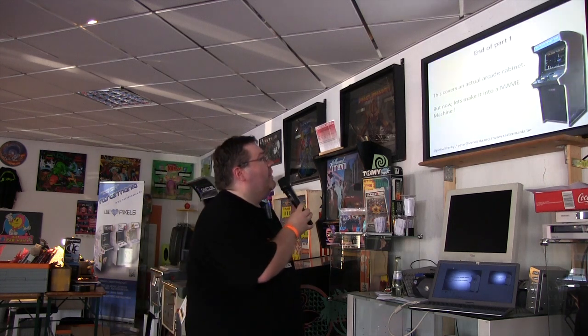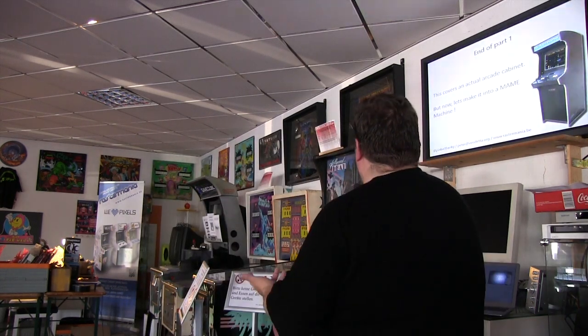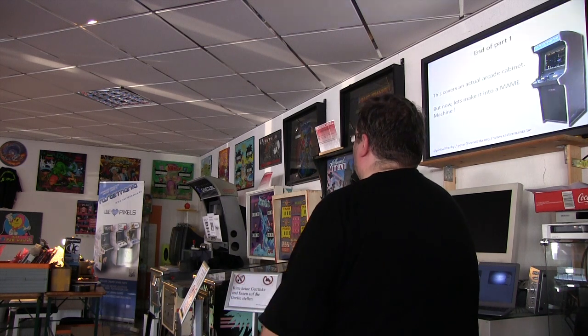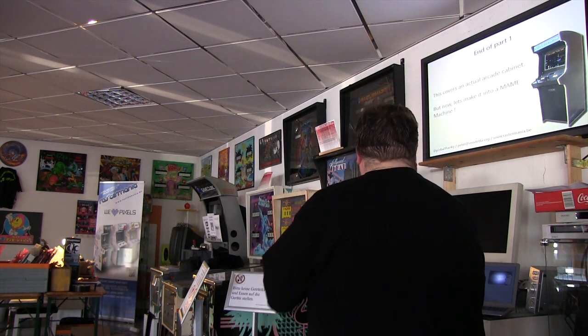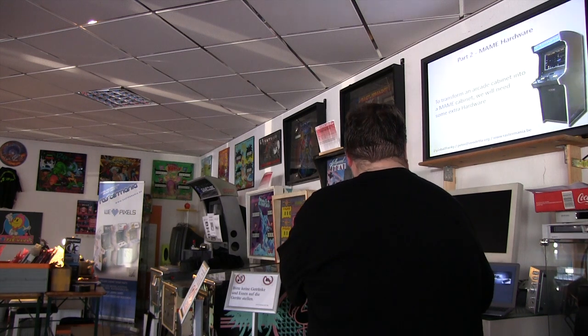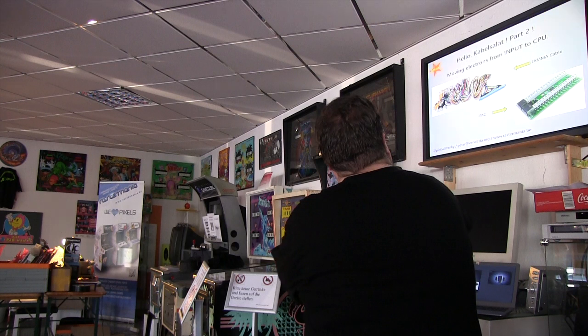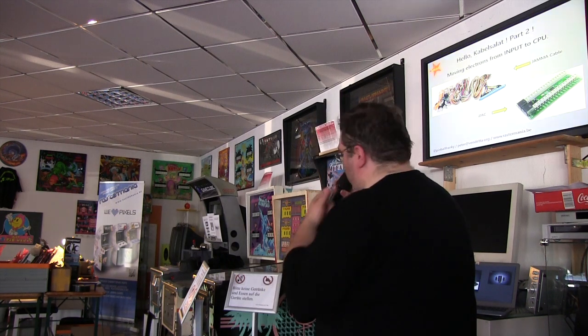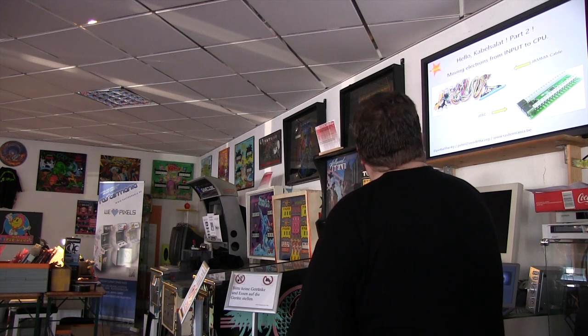So they would like to put a PC in there, and that's about half of the cabinets we sell, either with a multi game or ready for a MAME PC. First of all, you need some extra hardware, because your JAMMA cable will not talk to your PC with USB or keyboard. A device called the I-PAC will.